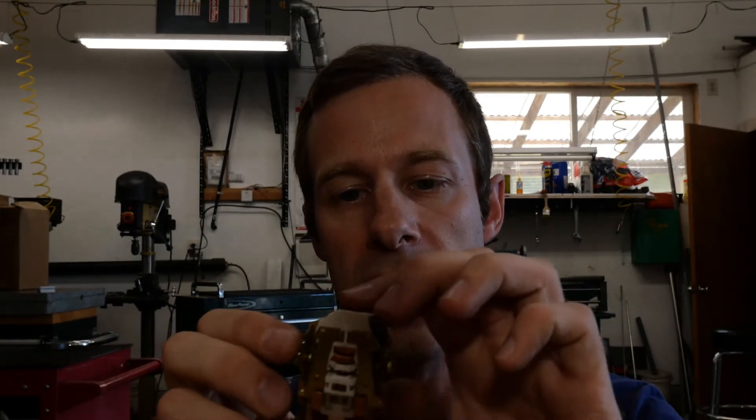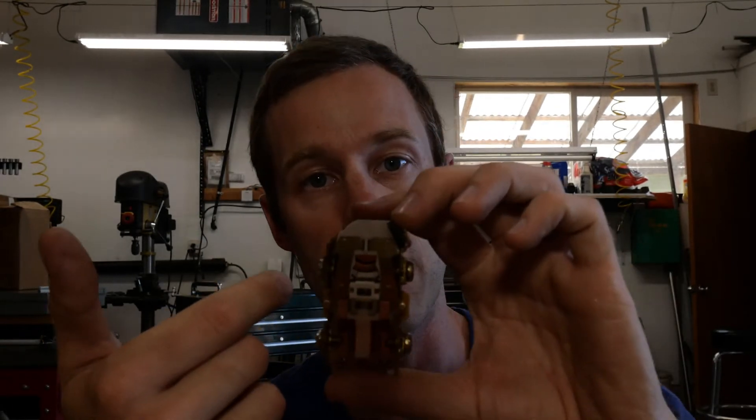These coils are a current transformer, giving us an ability to test the amount of current passing through. If the amount of electricity that comes in through the black hot wire and returns back through the neutral wire is exactly the same, what current is that coil going to measure? Zero.